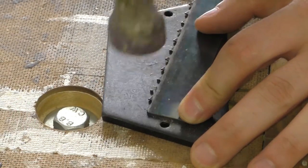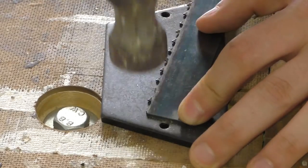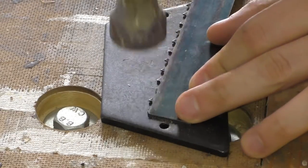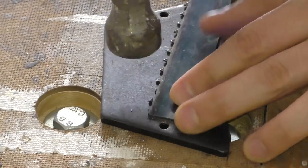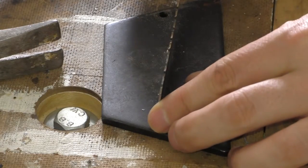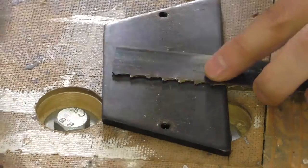In the previous video I made a simple inlay cutter from a section of bandsaw blade. It worked well enough but it had a tendency to catch in long grain. Through experimenting with how I held the cutter I realised that the problem was with the rake angle. Ideally I wanted a cutter that had zero or perhaps even a negative rake so it scraped the fibres away.